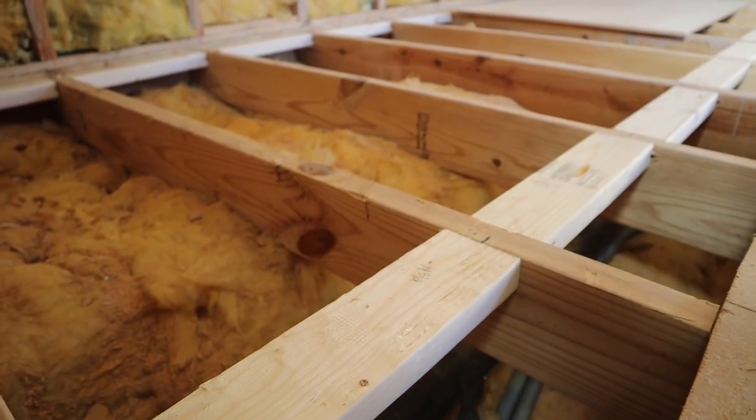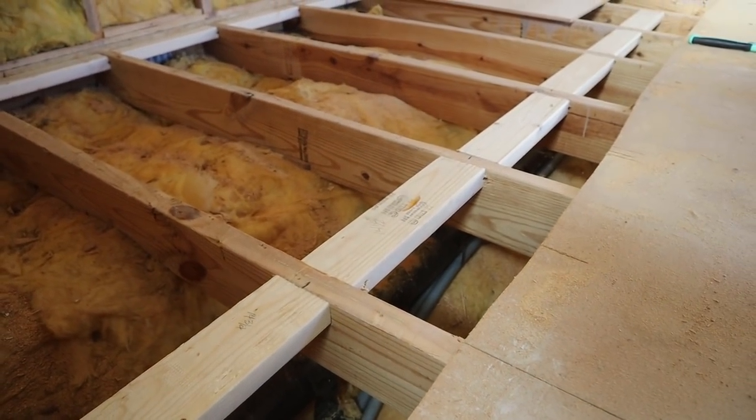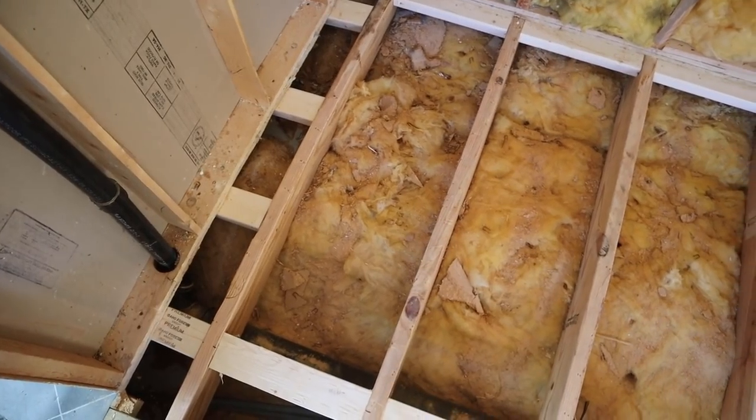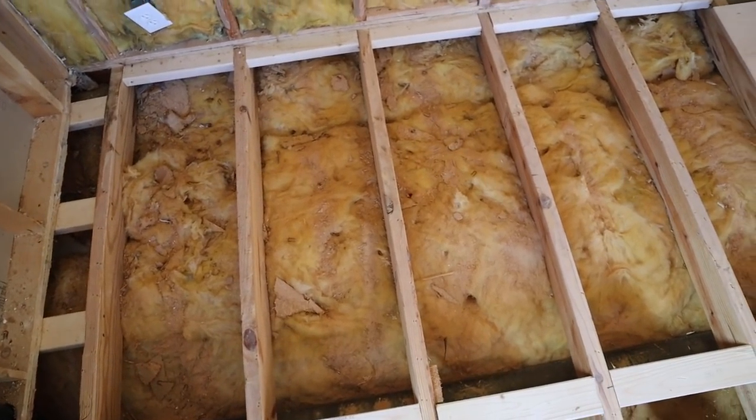All right, all of the blocking is done. We have it along the seam of what will be our plywood seam on the new floor. Then we have it done on the exterior wall, where it meets the exterior wall. And we also put it on this side, which, with a mobile home of this vintage, they don't put your walls on top of any studs. So this wall's floating and it's kind of sagged over the years. We braced it up, forced it to our will as much as we were able to. It's properly secure and ready to go.